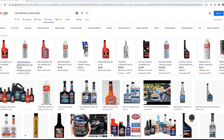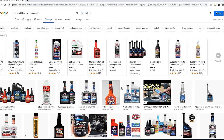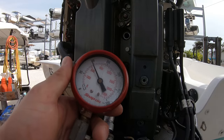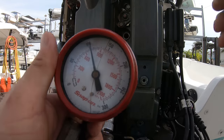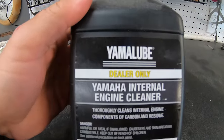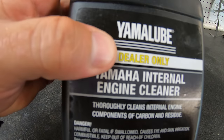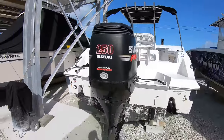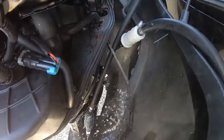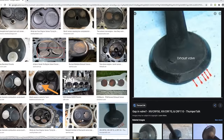Both are great products and I would try to go with the OEM fuel additives simply because there are so many different aftermarket products with different chemical compositions, some of which can have adverse side effects that you don't know about. Back to our compression test readings — some cases of carbon build-up can cause the valves to not seat properly and give you lower compression readings. There are also other treatments out there to burn off the carbon without having to pull the head and clean out the valves manually, such as Yamaha's Internal Engine Cleaner, also known as YIC. Because of how powerful this chemical is, they don't allow it to be sold publicly — it has to be done through an authorized shop. But on older engines without warranty, you can take Ring Free or Quick Clean and mix up an external fuel tank with a heavier mix of the cleaner, then run a couple of gallons of that through the engine to help burn off the carbon and bring the compression readings back up to normal. This must be done carefully though, because you can damage the valves and the deposits can burn up parts of the valves as well.